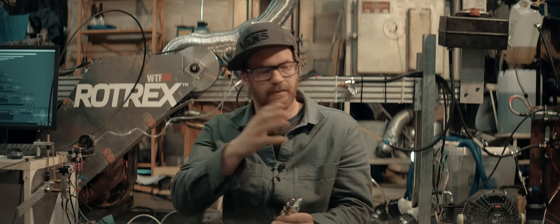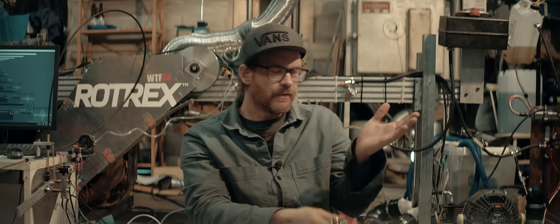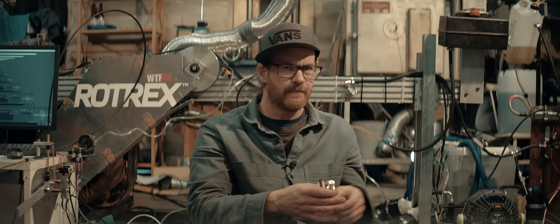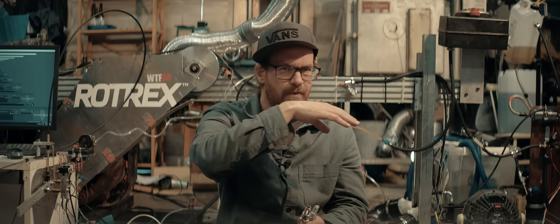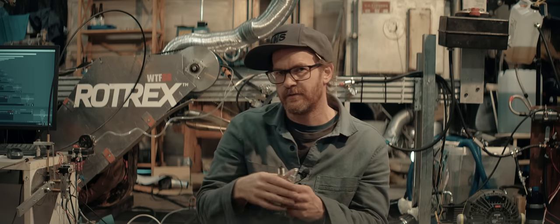Anyone with some experience in tuning engines would hear that this is running rich and say jet down. The thing is, I don't think it's running rich. It's acting rich. But the problem is the trapping efficiency before the pipe hits. That's our problem. We need to be really careful about jetting down any more than we've already done, because when the pipe hits, that rich condition might turn into a really lean condition quick.